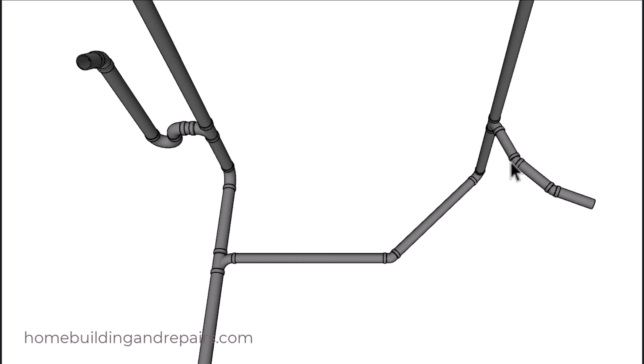This line for the kitchen sink will need to be inch and a half. We're going to have a sanitary tee fitting with inch and a half on the side outlet, two inches on top, and two inches on the bottom — or you could use a fitting with a two inch bottom, an inch and a half side outlet, and inch and a half coming out of the top, which is normally what I would use to hook up a kitchen sink. For the wash machine we're going to have a two inch long sweep 90 coming up to a two inch sanitary tee — two inches all the way around, or two inch bottom, two inch side, and inch and a half vent. Then we use a trap and come up with a 45 to finish the connection for our laundry drain.